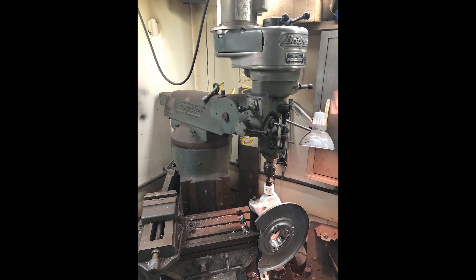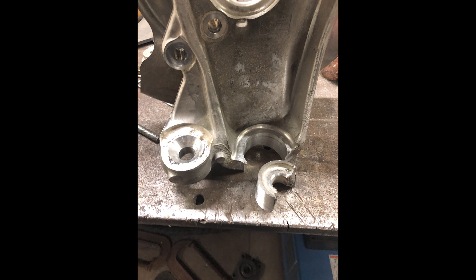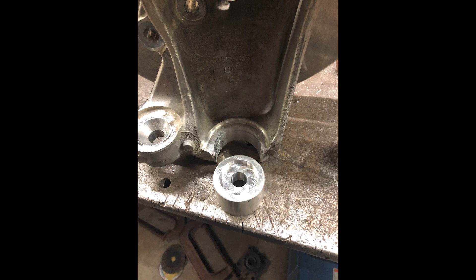Next step is a bit tricky — over to the manual Bridgeport we had to cut the old taper out. I used a two-inch hole saw with a little bit of fixturing off the edge of the table, which gave us a really nice clean cut. We cut out that broken part of the taper in a clean straight operation, ready to fit the new taper in.